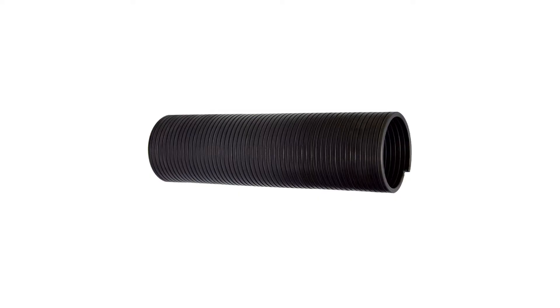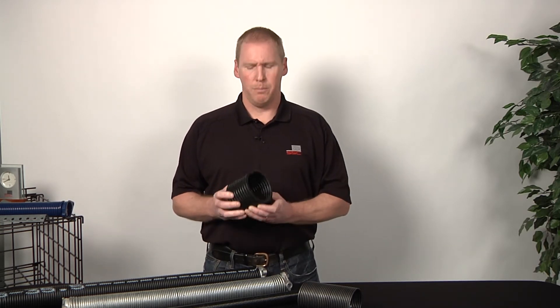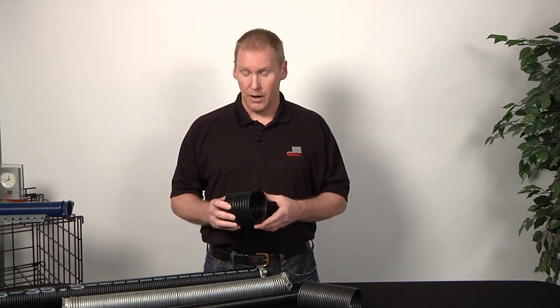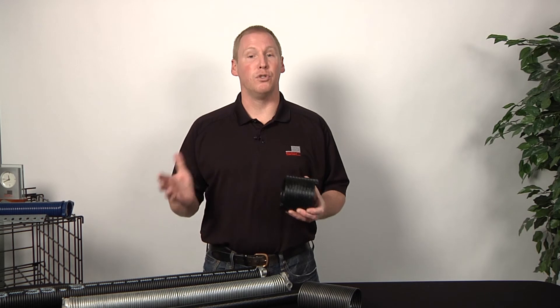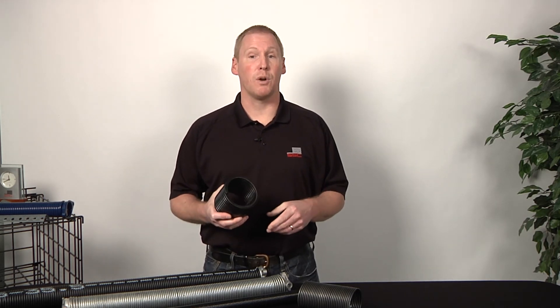Square wire is also available to make a garage door torsion spring. Square wire comes in handy to coil springs for installations where shaft space is limited, as it allows for greater energy storage in a smaller area. Because of space concerns, square wire is typically used for rolling steel doors. It also provides an alternative for duplex springs or multiple shaft setups. A common use for square wire springs is on high-speed roll-up doors that need more than a hundred thousand cycle life.